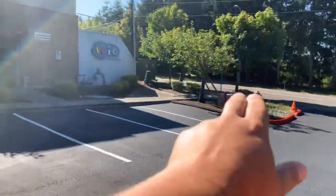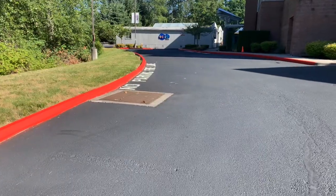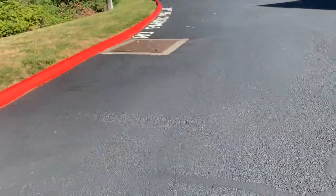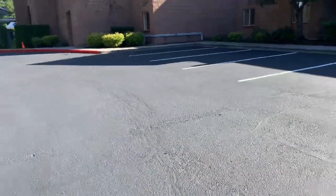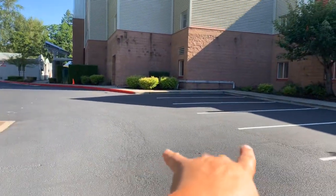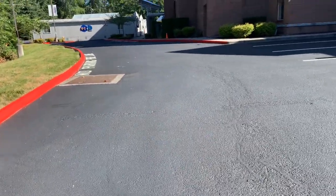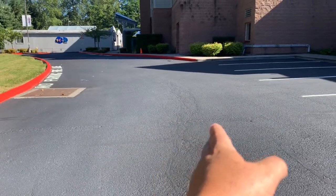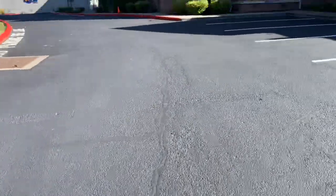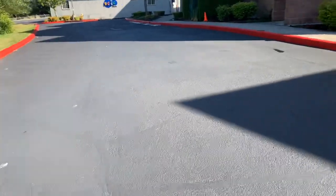All right. So if you go 1, 2, 3, 4, 5, 6, at the 6th stall, just before that grate there where the vault is, there were 2 speed bumps here. This is where we're going to put one here, and we're going to put one here. Okay, so each speed bump is 6 feet, but I'm going to make each one of these 8 feet, okay? So we're going to go 8 foot, and then do a 1 foot space in between, and then go 8 foot, okay? So take the center of the drive aisle and go 6 inches over and do an 8 foot speed bump, 6 inches over from the center, do an 8-foot speed bump. Okay, we want to paint them yellow. So make sure to paint them yellow. So that's your first 2 speed bumps.